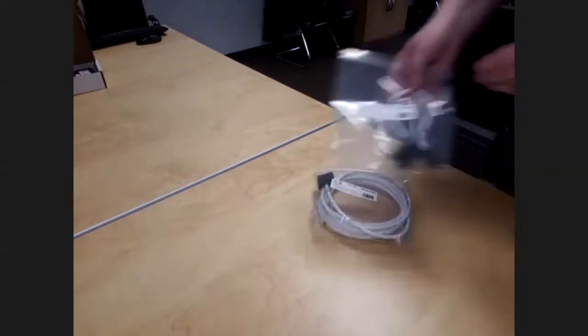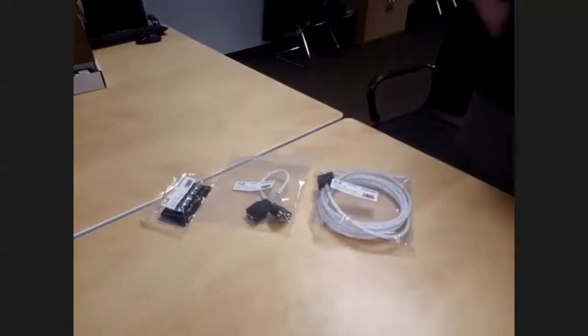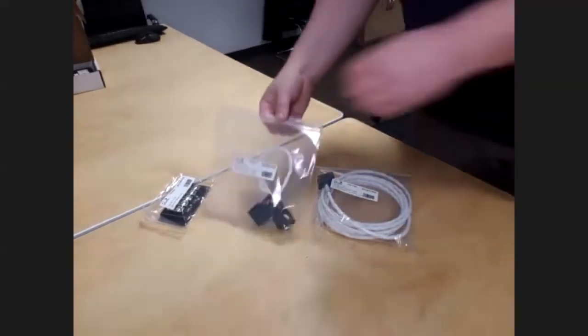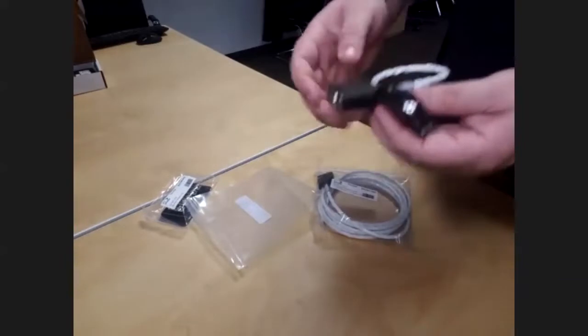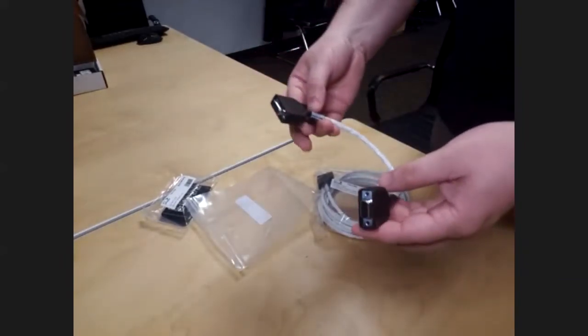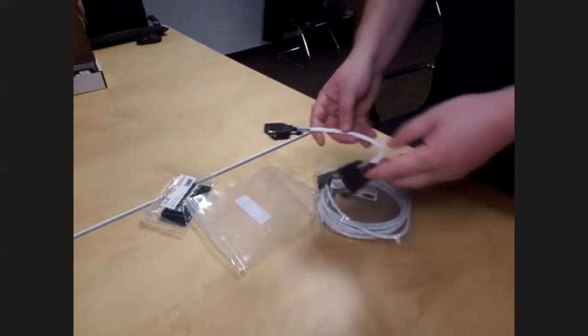All right, next up, I think we're going to show off the SkyView network cables and the hub, kind of the bits and pieces that connect the modules. The majority of SkyView components connect via what we call the SkyView network. These are 9-pin cables. We offer them pre-made from end to end with connectors on them, as short as this one, which I believe is an 8-inch, all the way up to 6 feet, in a number of different lengths to make the wiring an easy plug-and-play cable.